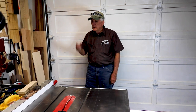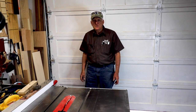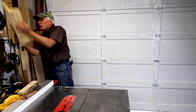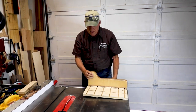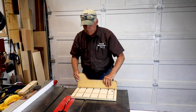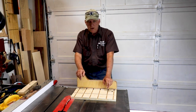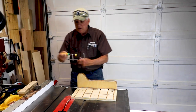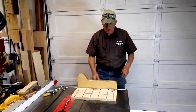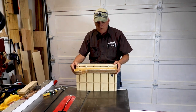I'm going to show you my little cross-cut sled using the match fit clamps. For quick cuts where I don't want to hassle with the big sled, I grab this mini sled. It's a one-runner sled cut with dovetail grooves so I can use my match fit clamps. It has a flexible fence — not a fixed one — and I've tested it with the five-cut method.